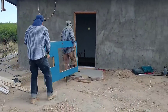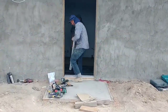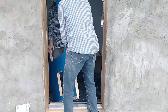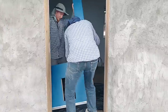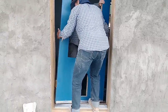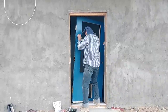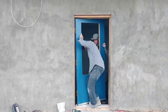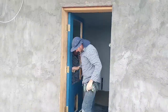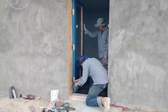This is something I look forward to. Once we get to this part it gets a little more enjoyable — the most difficult part for me is getting it to fit in the frame properly, and once you have all your clearances right and it's fitting good, it gets to the more enjoyable part of the process. Now we're situating it in place and propping up the base to get it exactly the right height and then screwing in the hinges. We're testing the swing, making sure that all looks really good, and then putting in the rest of the screws to complete hanging the door.